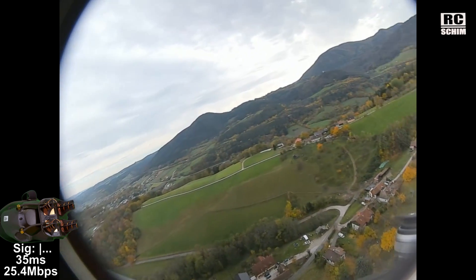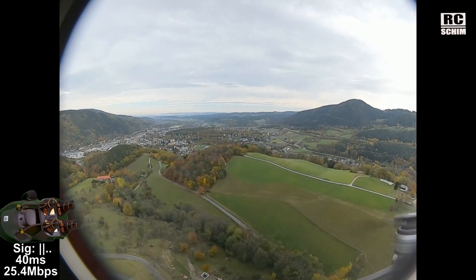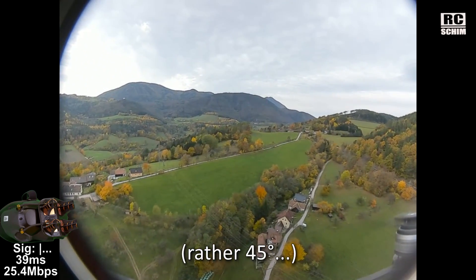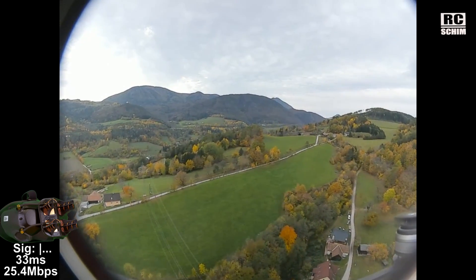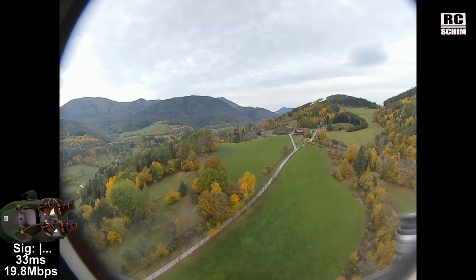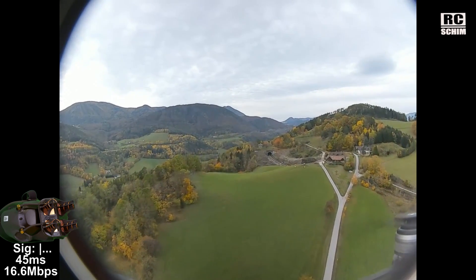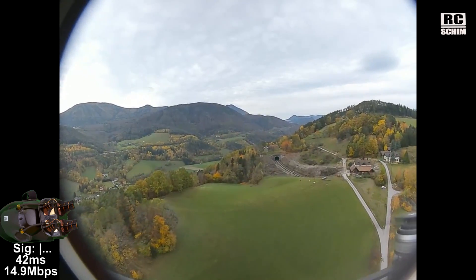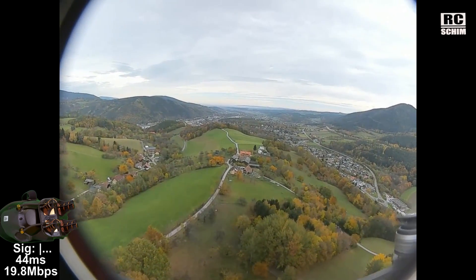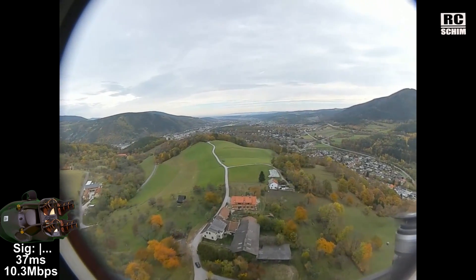Let's make an additional test. You know I'm pointing my goggles in this direction, and now I'm standing right in the middle of the screen by the trees — I think I'm almost 90 degrees away from the cone of reception. Let's see how far we can go up there. I know for reference that the green area before the tunnel is 800 meters away — 800 meters on the side of my reception. Now the signal is dropping, but you can go really far on the sides of the reception cone. That's the advantage of the three-turn helicals rather than higher gain antennas — you can almost fly like those were omnis.